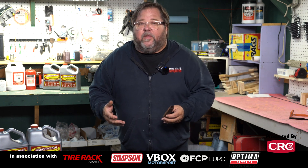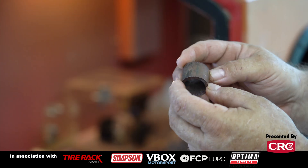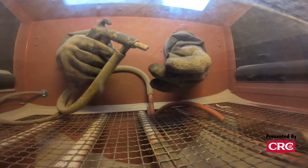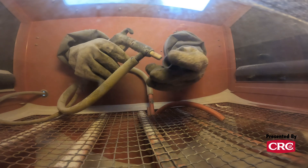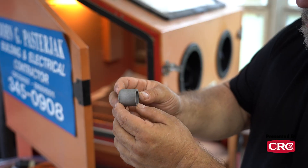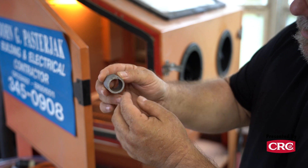There are a few common things that we do in the Grassroots Motorsports shops to deal with rusty pieces. The first method is a physical method: media blasting, sand blasting, glass bead blasting. It's a very thorough way to clean your pieces of rust. It also works fantastically on pieces that have concave surfaces or interior parts that are otherwise inaccessible with brushes or other abrasive methods.